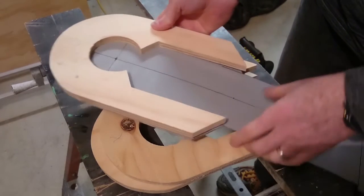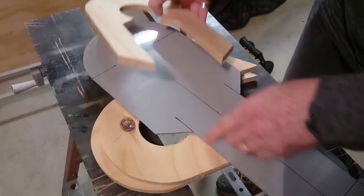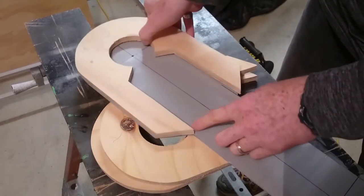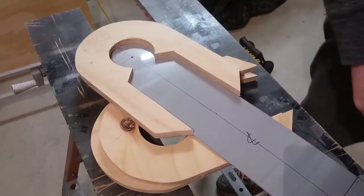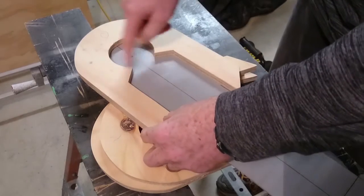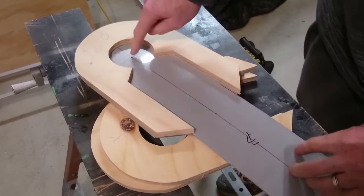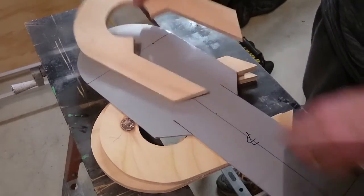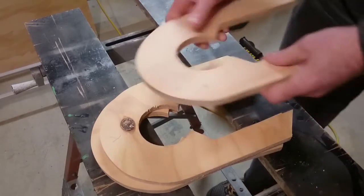You mark along here and basically just come in with this line here, so we've got a line continuation. That's your thickness all the way up. The measurement - I can't remember what it was, but there will be a link in the description. That's about a 76mm hole we use with a hole saw, using that point there as your reference point to mark that hole. We need four of these, two for each leg.